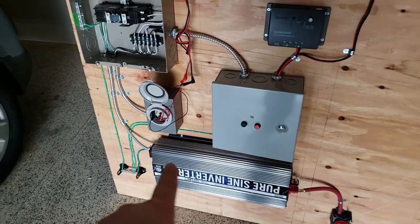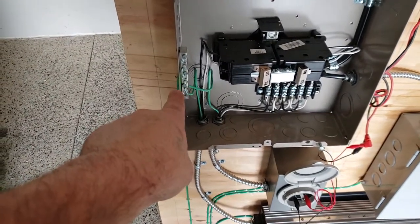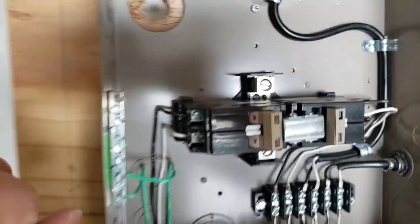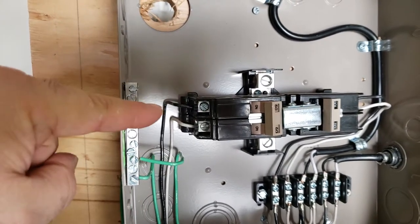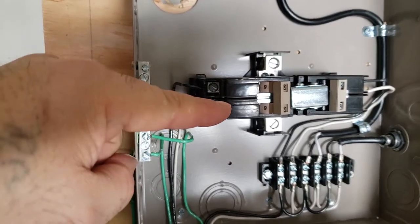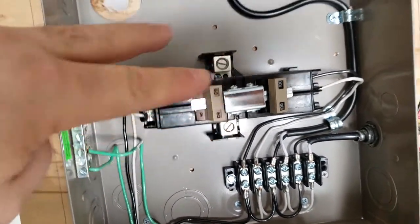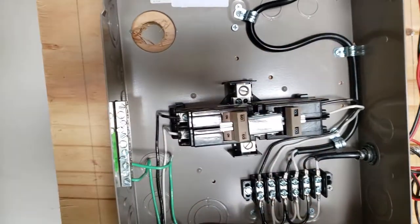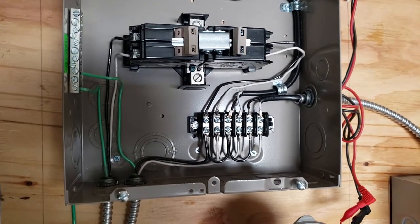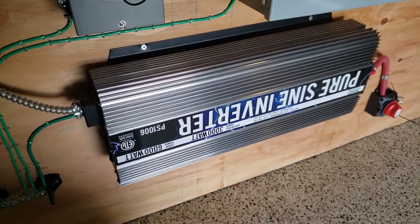The batteries will feed the inverter, and the inverter's AC output goes up into the panel. I've got the ground bonded to the chassis of the panel, and on this breaker I've got the hot going into one end and the neutral going into the other. I'm only going to send two wires — the hot and the neutral — through the conduit all the way over to her house. The reason is that the house has traditional wiring where the neutral and ground are bonded in the panel, but the inverter's ground and neutral are not bonded whether the inverter is on or off.